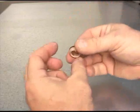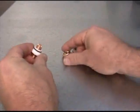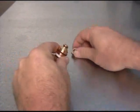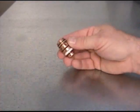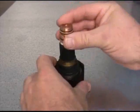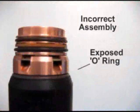The individual parts can now be assembled. Begin by placing the electrode into the plasma gas distributor, then place this assembly into the tip. Now add the shield gas distributor and finally the shield cap. Be sure they are all firmly seated. This five-piece assembly can now be placed into the consumables cartridge — hold the cartridge upright while inserting the assembly and press the consumable parts firmly into the cartridge. Observe the interface between the end of the cartridge and the tip; the O-ring should not be visible.